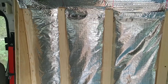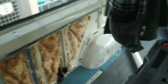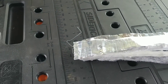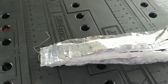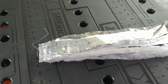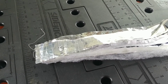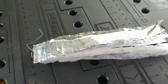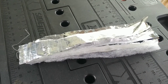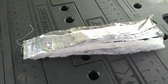I thought I'd try something different — something I've not seen anyone use before — and this is YBS Super Quilt. It's a foil product, so you have a stitched seam with a fairly heavy duty plastic layer on either side, then layers of insulation and foil. It's a very heavily used product in the building industry.